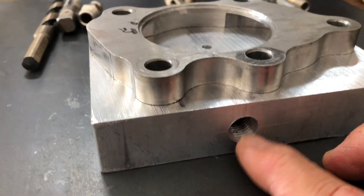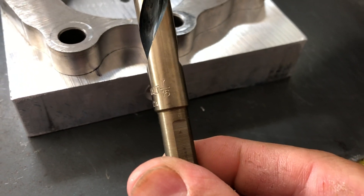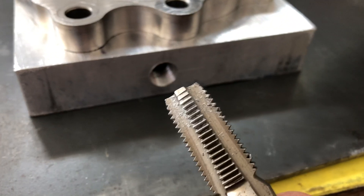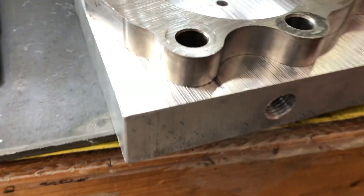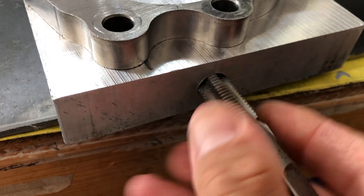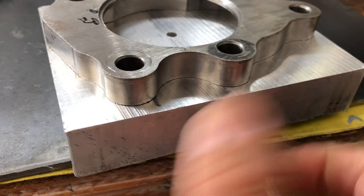This one's already finished. I used a 7/16 drill bit for a quarter-inch tap, but I like to do it in steps — pilot hole first, then gradually work up to the last drill bit. Quarter-inch tap here — this is going in easy because it's already finished. Make sure that you test-fit your fitting, and like I said, if you want the fitting to go in deeper you're going to have to drive that tap in deeper as well.